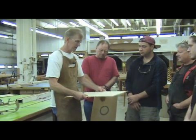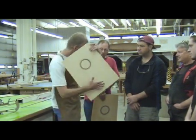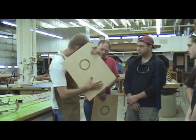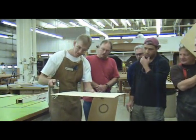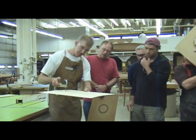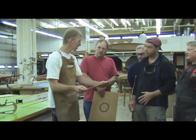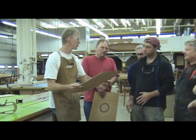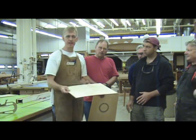I am not necessarily worried about a specific number for my top thickness, but rather about the stiffness and musicality of the top. I am working with certain numbers in mind, but I don't let those determine how thick or thin to make each individual top. I only use these numbers as guidelines and then I let each top tell me how thick it wants to be. After thicknessing the top, I check it with calipers to make sure it is within my guideline parameters.